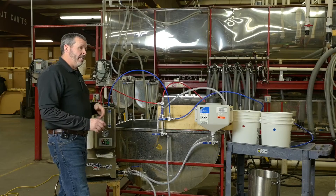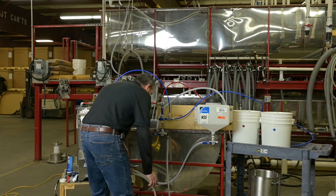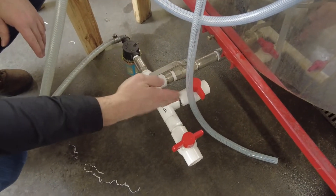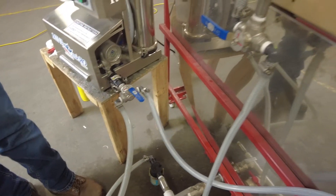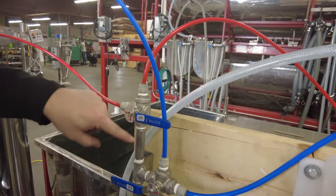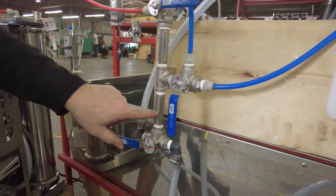Step six: testing. I'm going to take you through three steps — a rinse, a concentrate, and a wash. Starting with rinse: we want to make sure that we have our permeate coming to our machine. Look up at the V6 valve, make sure the arrows are aligned — arrow going into the feed pump, arrow going to the tank. Then look at the V4 valve — switch that valve so the arrow is coming from the machine into the three-way valve system. Same with the V3 valve. The V18 valve should be directed from the three-way valve system to the drain.